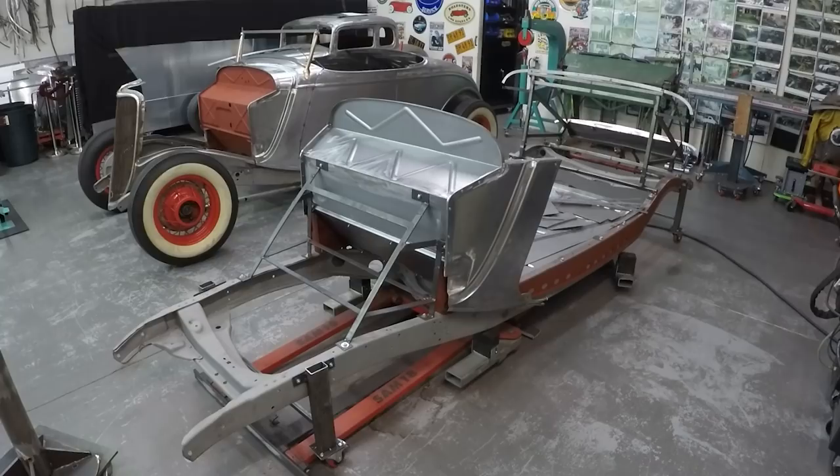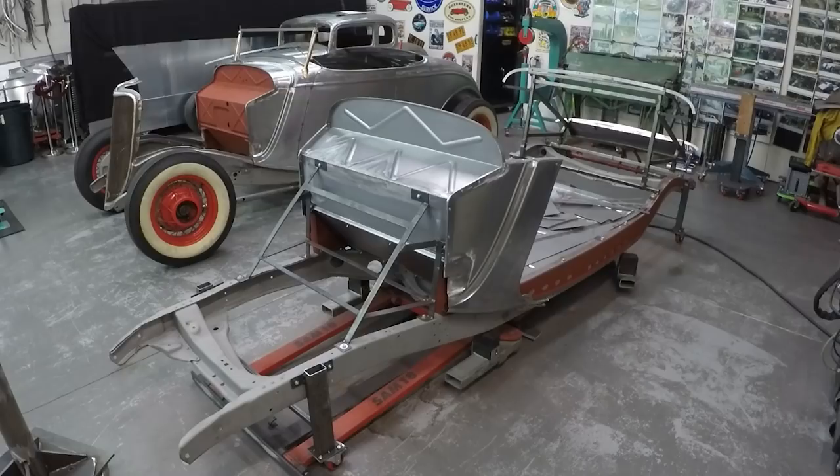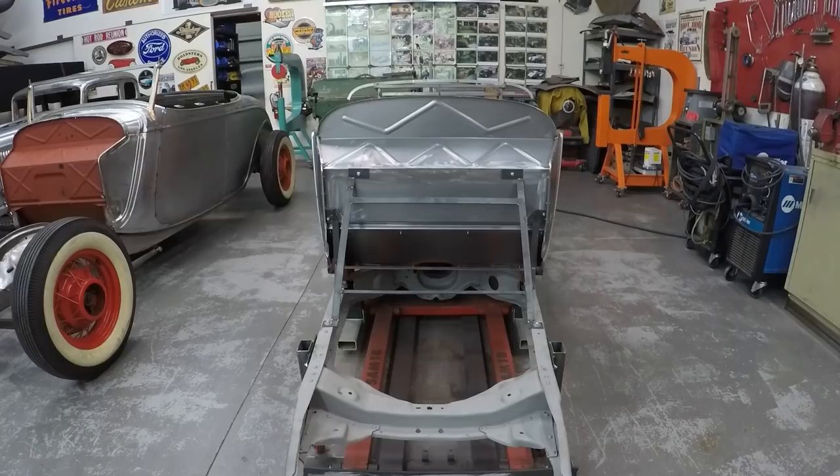This is after two days, and we're going to continue on Wednesday — three more days to go. I think we can get pretty much done for the '33 Roadster. Here's another view of the firewall and the jig, and you can see the sides of the cowls on each side. It's important to look from the front view so you can see they stick out the same amount.